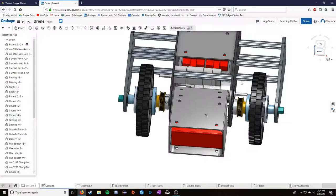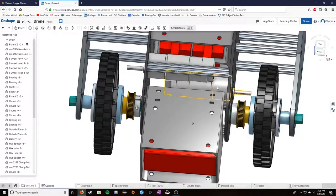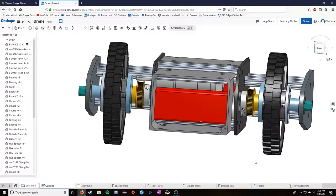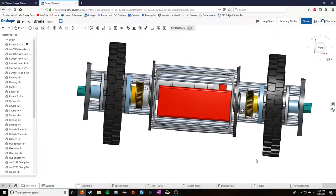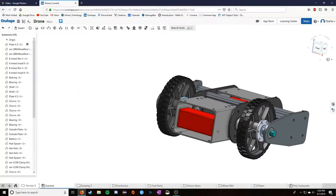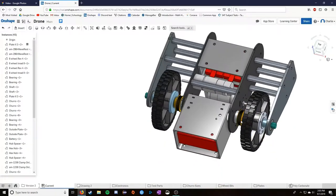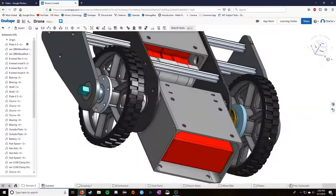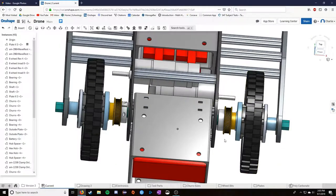It's kind of hard to imagine how this works, but on the inside of one of these motors is a gearbox, very delicate gearbox. If this motor is spinning really fast, which these motors do, and then you crank the shaft, say up or down, then your motor's going to be in real trouble. It really is going to start breaking gears, and I've done this before. It really does hurt them. So that's how I avoided that here. I have these properly fitted bearings and the belts and everything to make this work.